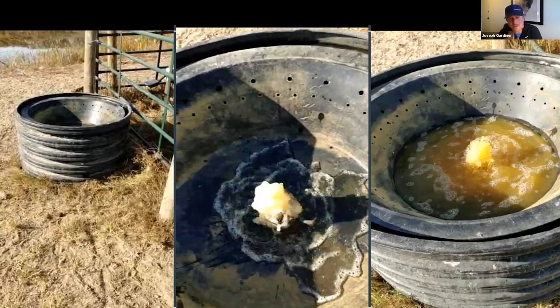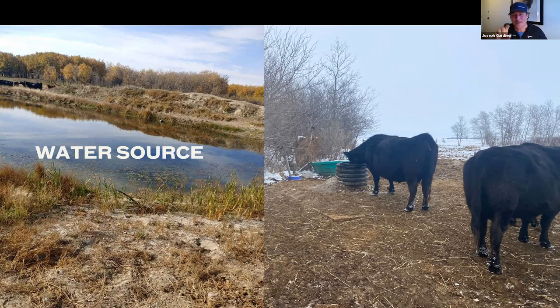The picture on the right is Owen's system. Owen has 200 cows on a bale grazing system in winter, and solar panels alone can't keep up - they have to bring fresh batteries every two or three days. For 200 cows at roughly 10 gallons each, that's 2,000 gallons a day pulled from 16 feet - a significant amount of energy. Think how much energy that would take if you were filling buckets manually.